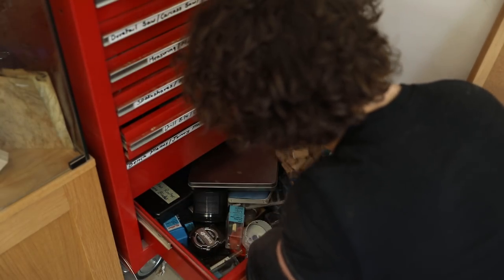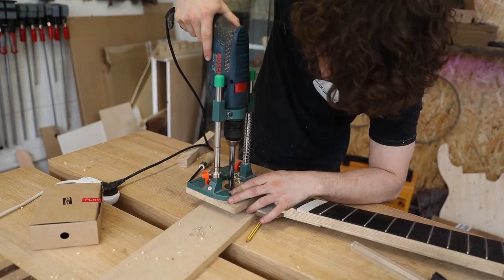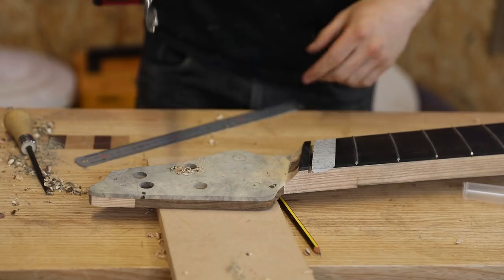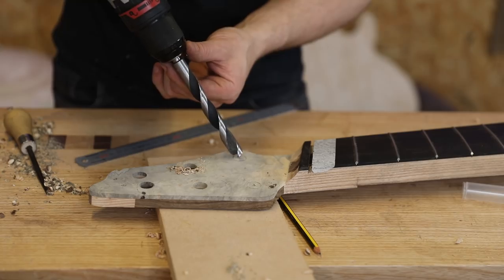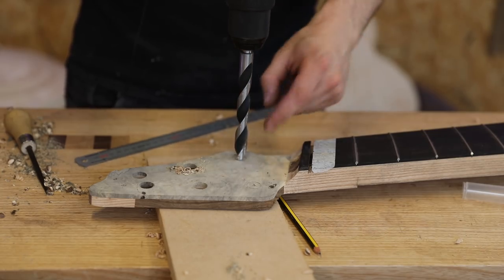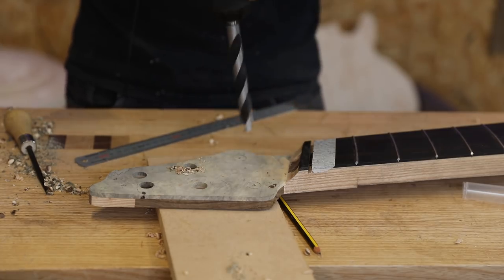Then I search for a 14mm drill bit — found it easily. For the last two holes I can't get the drill guide close enough, so I'm doing it by eye. A tip: put the brad point into the marked point, then drill very slowly and watch whether the edge of the drill bit hits the circumference of the circle at exactly the same time all around. If it's tilting off to one side it'll cut one side before the other, telling you you're off at an angle.